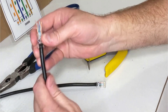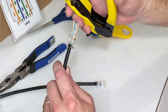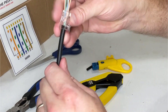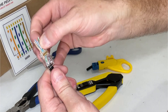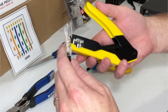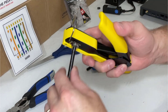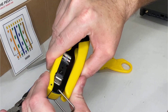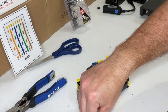The next step is to use the Klein crimp tool. When we put the connector in here, not only is it going to depress the mechanism on the side that crimps down on top of the wires to make the wire connections, but it's also going to trim off the wires off the tip. So we bundle them up, put it through — you can see how it follows the profile pretty exactly, with the wires sticking out the other side. Depress it all the way and let it out, and now they're fully trimmed off. You can see all the little pieces of wire just fell right off.